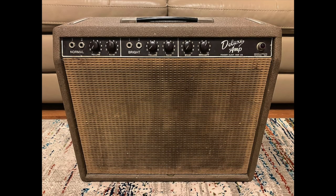So moving to the Brown amp, we move to three 12AX7s in the front end, which is really similar to our favorite amp from England. It's not exactly the same preamp design, but you know, getting a lot closer. It also used a long tail pair phase inverter, really similar to Marshall, as well as the negative feedback circuit was really similar to Marshall. So a lot of things were moving in that direction at this point.